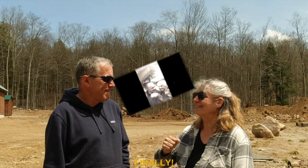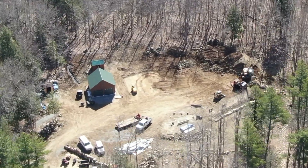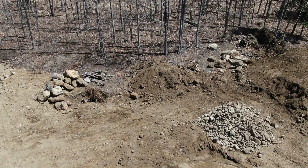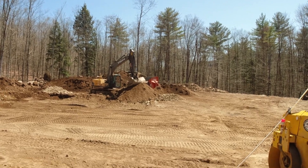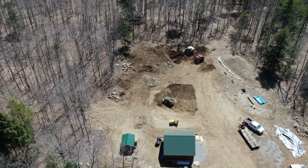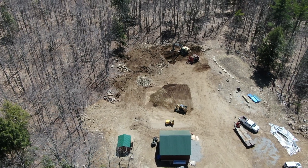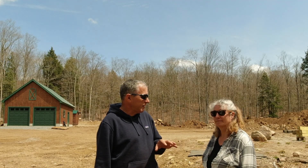The foundation — where are we at? Steve's been working really hard. He excavated about 18 inches down and sifted through all that dirt to get all the rocks out. We have a nice clean backfill of about 18 inches or so to prevent any heaving that might happen — there are no big rocks underneath the house. We've got the basic footprint of the house laid out, and he rolled it all down and compacted it again — it's smooth.